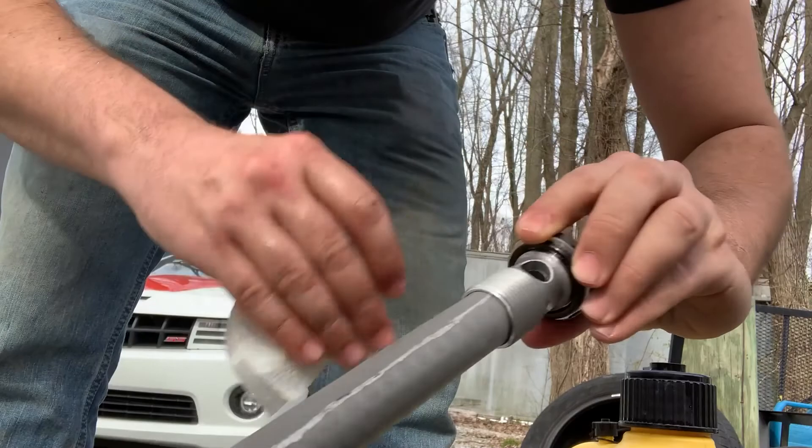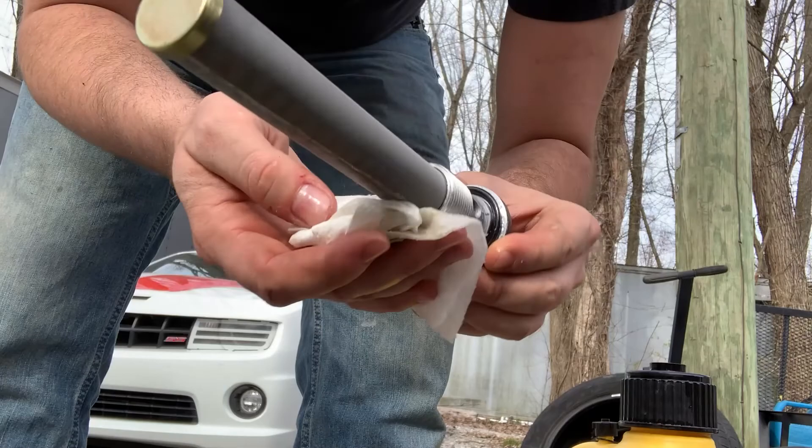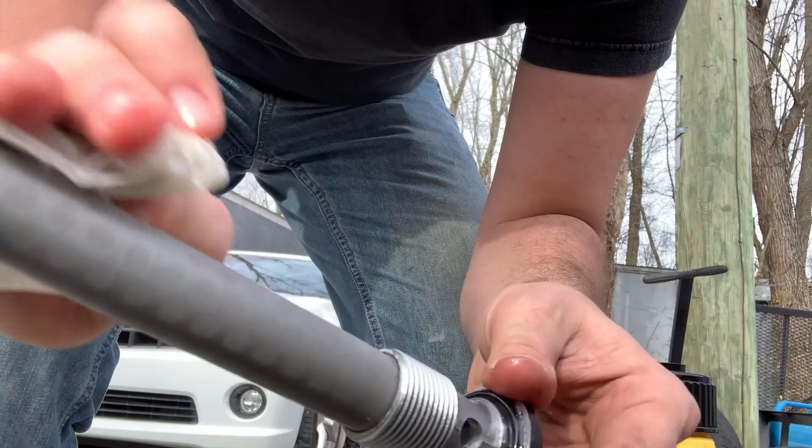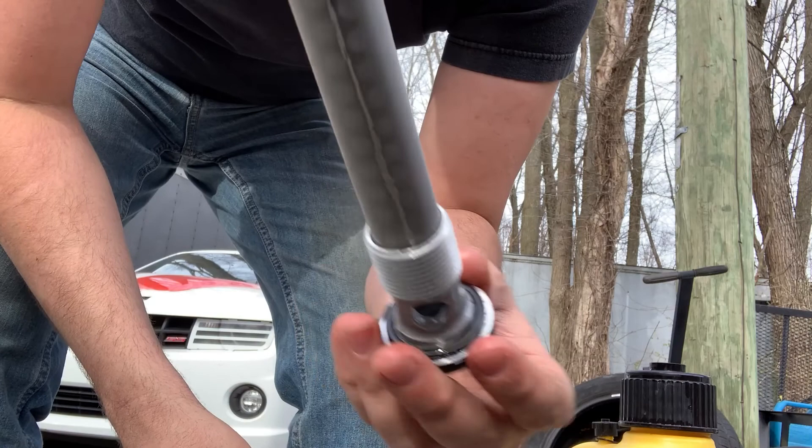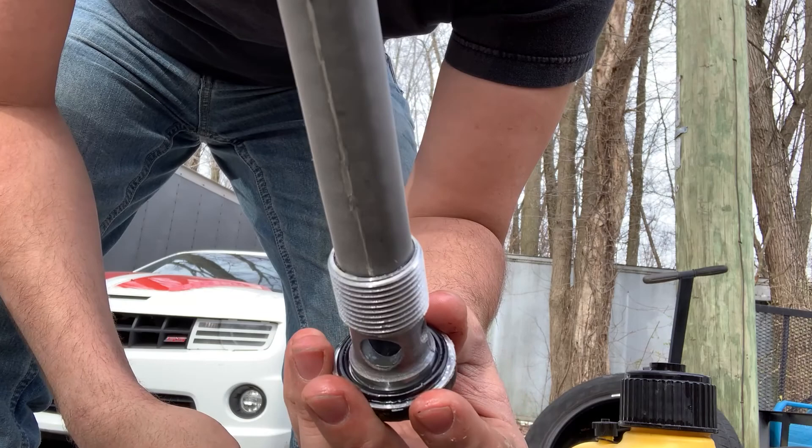Look at that — good deal. No more gunk, no more buildup on there. It's all clean of debris and everything. Like I said, make sure this little gasket stays on there — that's how you make a seal. It's so easy to forget and just screw it on there because it fell off in the drip pan, and then all of a sudden you're working and wondering why you're losing pressure — because you've been slowly leaking your fluid everywhere.